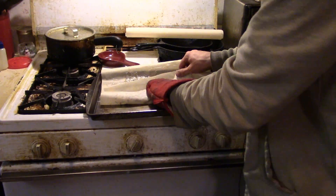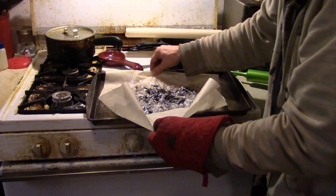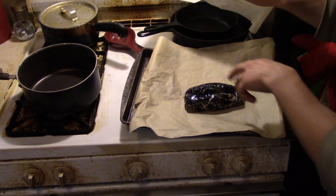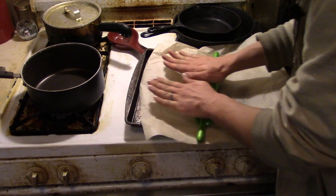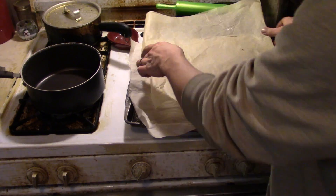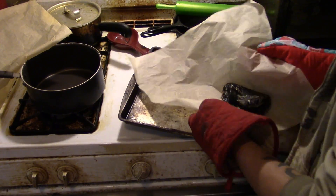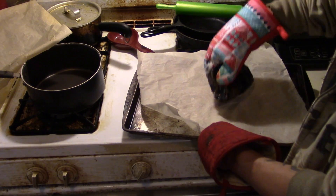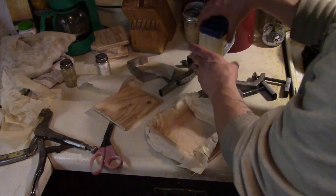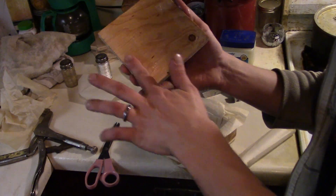When you're melting it down, as you can see here, it gets transparent. I just lay it out and start folding it up using the wax paper in a glove. Over time it'll cool down a bit and turn back to that white color. So I put it back in, get it back to melted point, and then start rolling it out and folding it until I get it right around the shape of my mold. As far as temperature is concerned, you're going to want to melt it right around 350 degrees Fahrenheit or 180 degrees Celsius — that seems to be the best working temperature. It has the consistency of chewed bubble gum: very sticky, very tacky. When it comes to mold prepping, I found that adding some Vaseline really helps reduce the plastic's grab onto the wood.